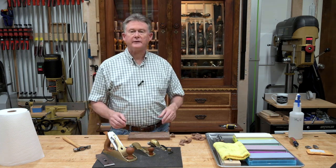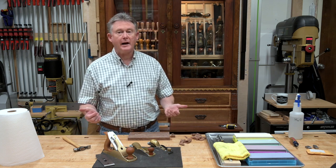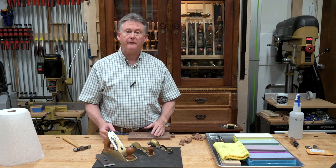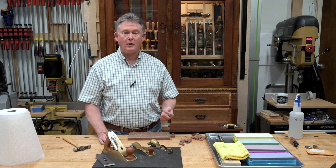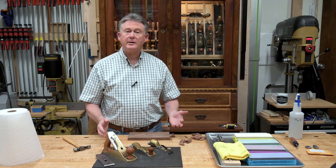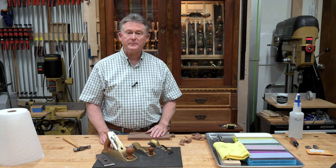So that's my process for sharpening hand planes. It's straightforward and simple. I hollow grind to expedite the honing process. I then hone and polish the bevel until I feel a burr on the backside working through the grits. I use the ruler trick to polish a micro bevel on the backside and then adjust the plane. Follow those simple steps and you'll get a zero radius sharp edge and a plane that can cut whisper thin shavings every time.